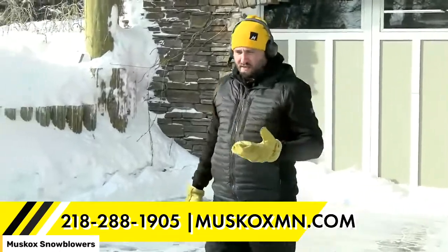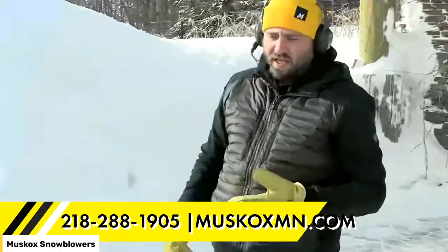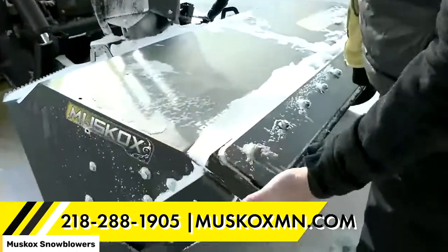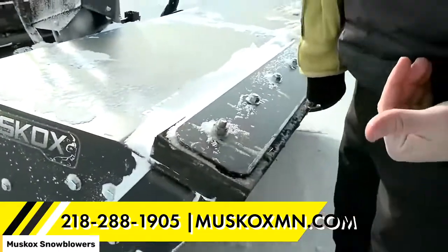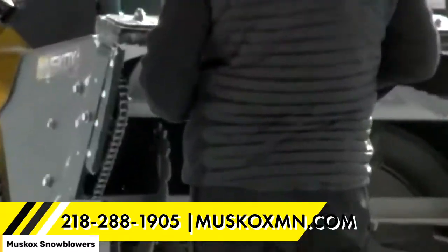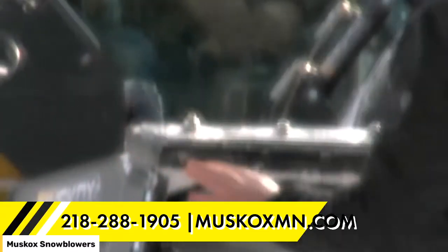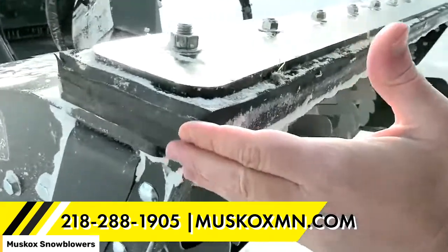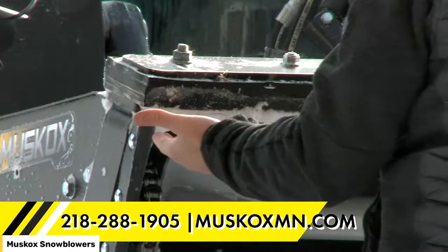I think John said I had a chance to show off one more feature, and I want to show up close with that rubber cutting edge. So it's a rubber cutting edge that we ride on top. On the bottom, it's steel, but on the top, we're riding on this rubber cutting edge. And with this machine, a very common question, hey, how often am I going to go through that rubber? This has got 140, 150 hours into it. We haven't even rotated it yet.